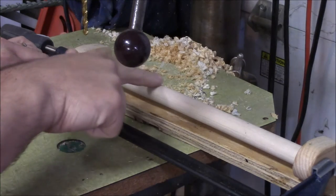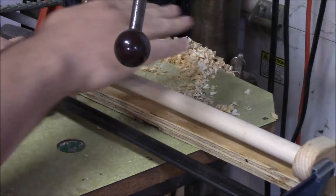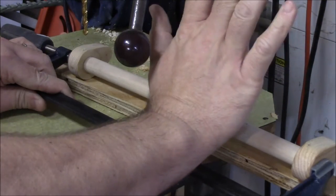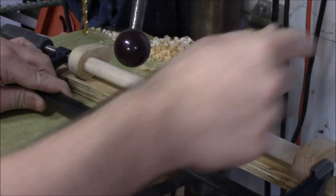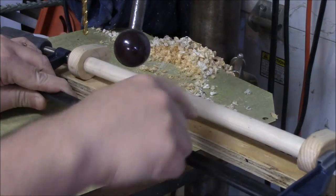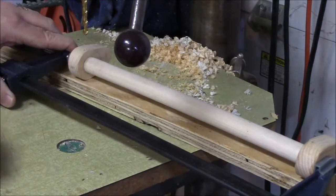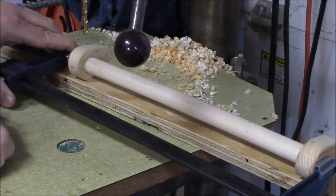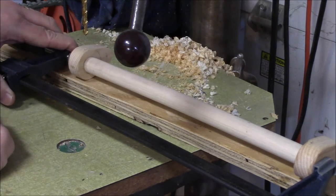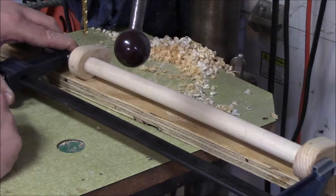Here at the drill press I've got the handle that will turn the snares on and off. The handles point in the direction that the snare is going — as you twist the handle, the snares will either come up or go down, so you can tell whether the snares are touching the front tapa or not. I've got a board underneath to keep them level. They've got a pretty good friction fit from the Forstner bit hole, but I'm also going to drill in some quarter-inch dowel rods — I think it'll look pretty cool with a bright white dowel rod showing at the end.